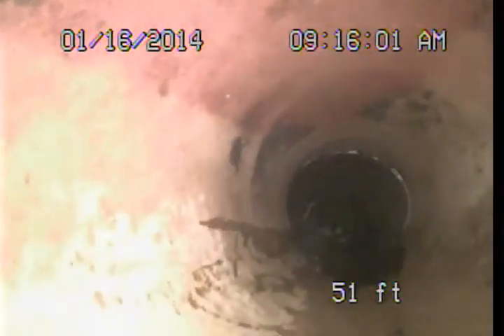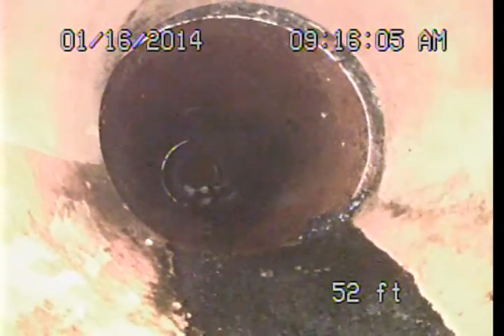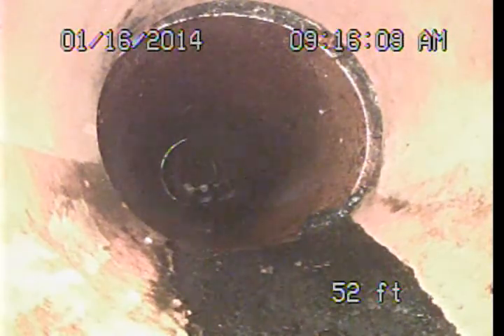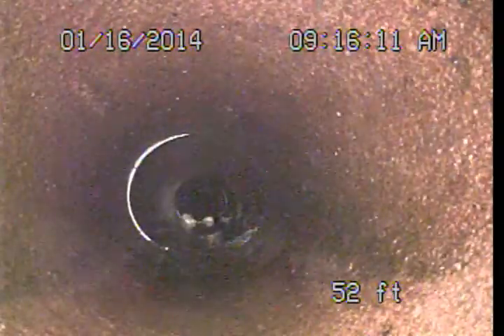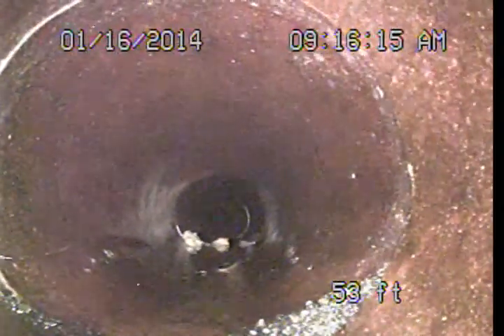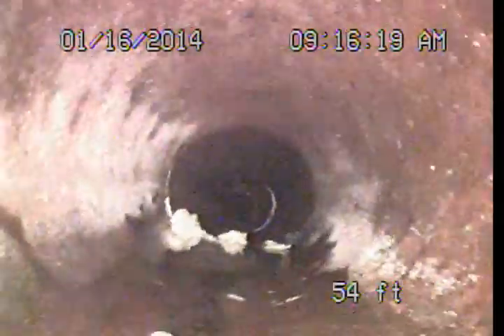Let's connect up to our clay here. This is where we encountered that blockage — as you can see it's been cleared and that line is now draining. These clay pipe materials are very common for main sewer line systems, especially the piping under the street, which we refer to as the lateral pipe.